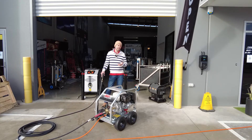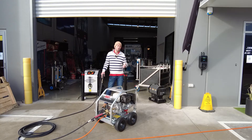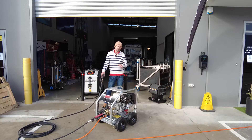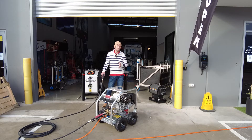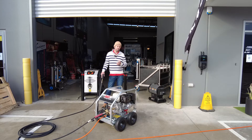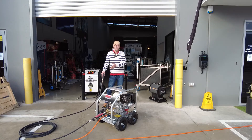So if we're running a surface cleaner and need to reduce pressure — whether it's sandstone or timber — on previous models or other options in the range, we can drop the RPM which will drop both pressure and flow. But on this particular engine it can be configured in two ways. As a true IGX, the RPM drops automatically when we release the trigger, and when we apply the trigger it goes back up to full RPM, meaning full pressure. So to adjust pressure in that IGX configuration, we need to play with the unloader valve or change the nozzle size.